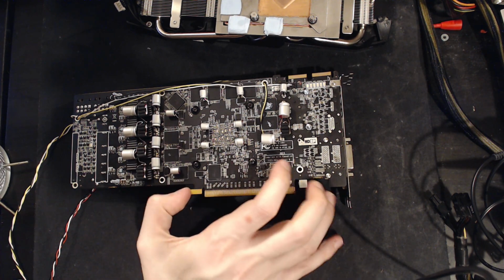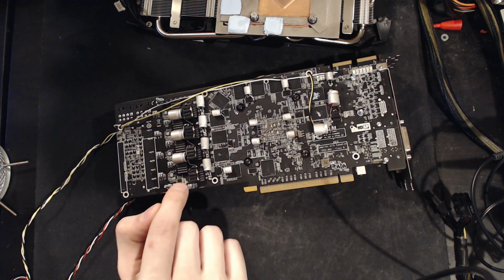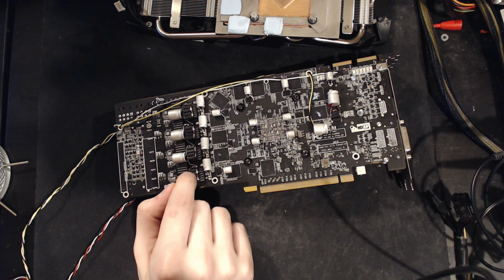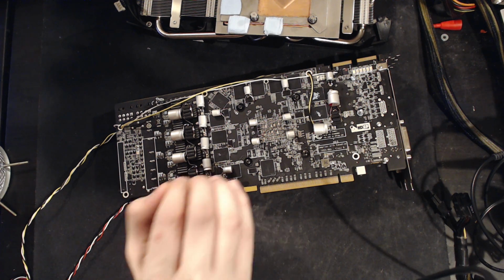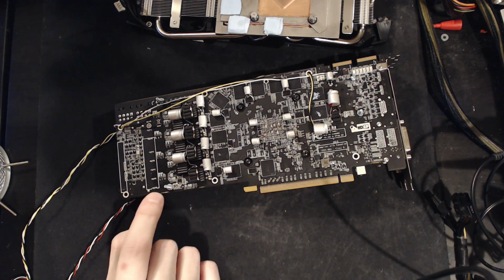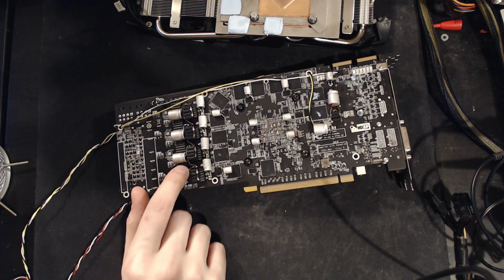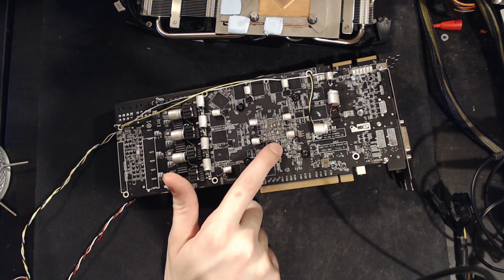The Vcore VRM, on the other hand, was just messy as hell. This thing was spitting out some 270 average and 300 millivolts peak-to-peak maximum voltage regulation. So this thing was atrocious. Well, not atrocious, but actually, it's by far the worst I've measured, because this was peaking at 1.4 volts, while the core was getting an average of 1.2.